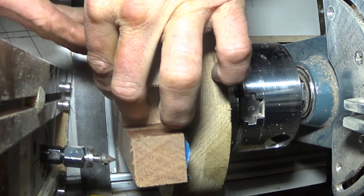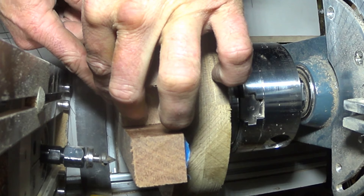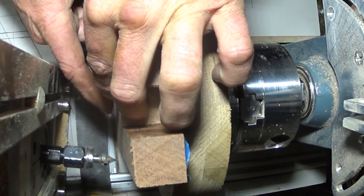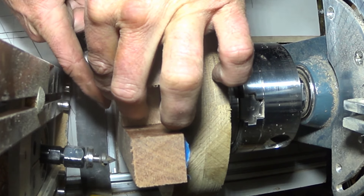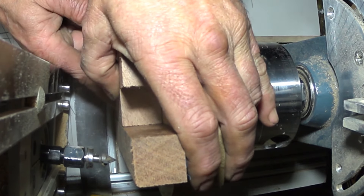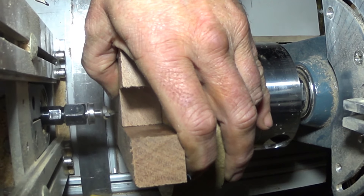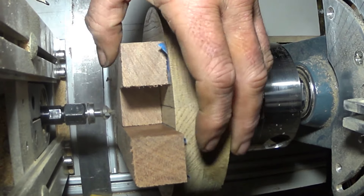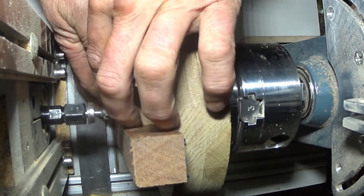The depth of that V-groove divides the face of that wood into three. I looked it up — just did a bit of Pythagoras theorem — and dividing that by three is 8.66, so to get a depth of V with the same length of face you've got to go 6.13 deep, or 6.1 deep. So I've got a depth stop set up at six, and just judge it to just try and make it just over six. On a router table you could be dead accurate with this. You'll end up with a V in every center pointing towards one of the holes in the block.